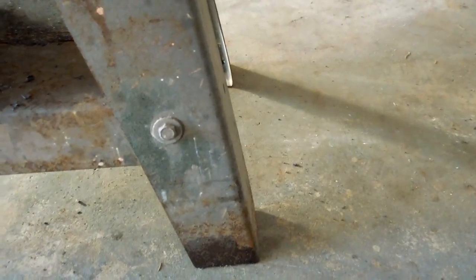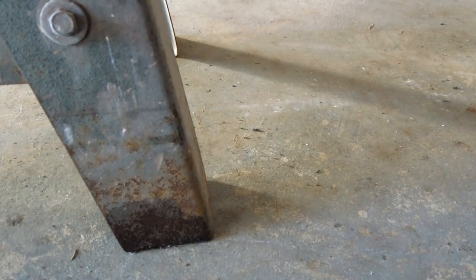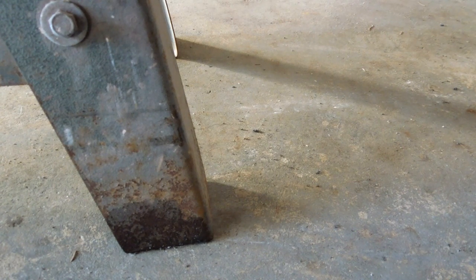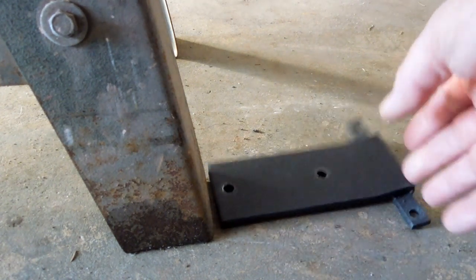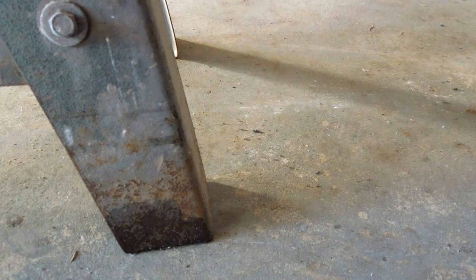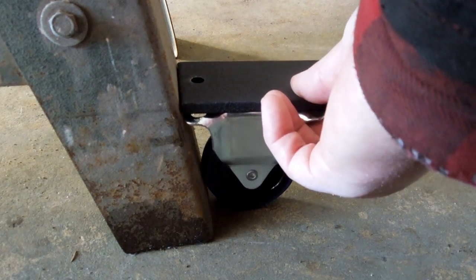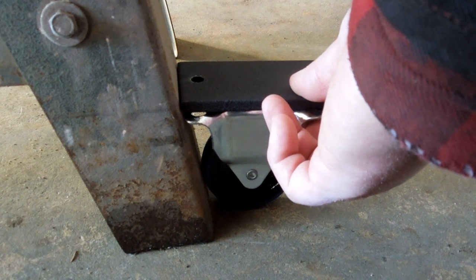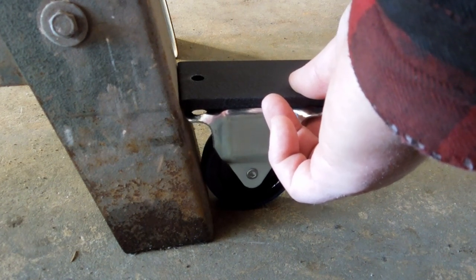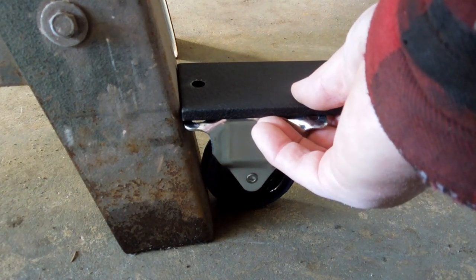This little saw didn't have wheels on the back — all it's got is just the frame. Rather than dragging this thing around on the legs all the time, I thought if I put a caster back here it looks something like this. Then it would sit down on the legs, and the minute I picked up the front end it would be on the caster. Having it only on two wheels, even though they're fixed wheels, I'll still be able to wheel it around like a hand cart.